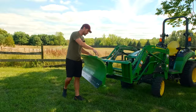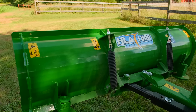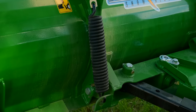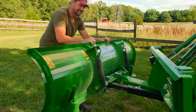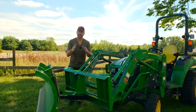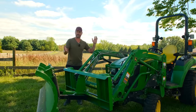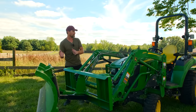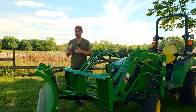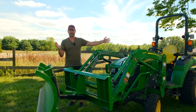They're going to have a pair of mold board trip springs on there too. So if you do hit a curb or an edge, or if you're pushing off your driveway and hit a hidden stump or something else, that'll have some give to it so you don't jar your tractor, your loader, and yourself. Important to wear your seatbelt. It's a basic thing to do - you'll hear about things in forums and YouTube comments or Facebook posts where they weren't wearing their seatbelt and just rammed into a hidden obstacle, came to a jarring stop. I remember one guy who broke his wrist because it just came to a stop and caught it the wrong way. So wear your seatbelt - just a simple safety thing.